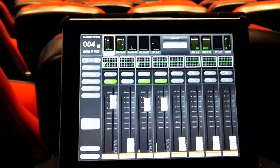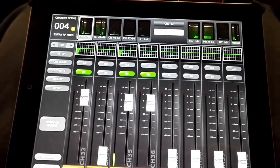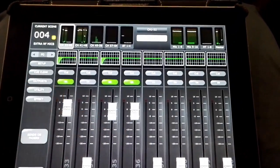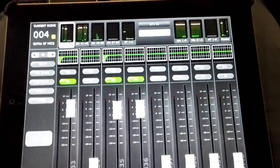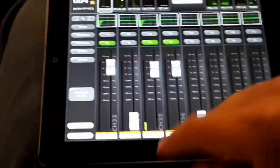And now what I'm going to do is ring out the microphones. Alright guys, so what I've done is I've decreased the input gain from the Clear One device for the microphones that I can't control the head gain of. Okay, so next I'm going to ring out all the microphones while they are switched on. Chris, if you can please speak into microphone lapel 6 again, please.